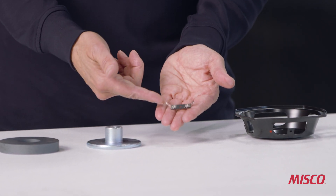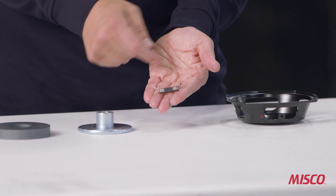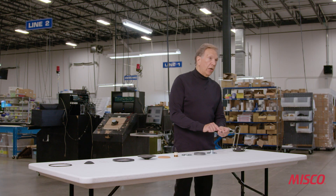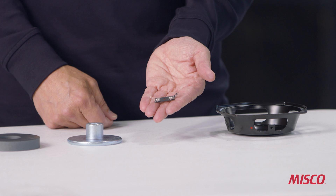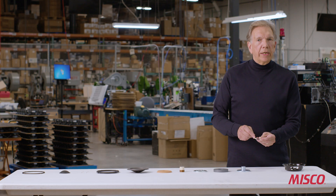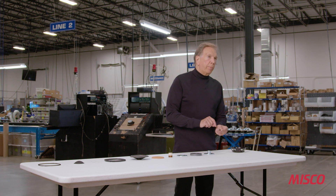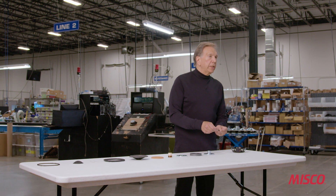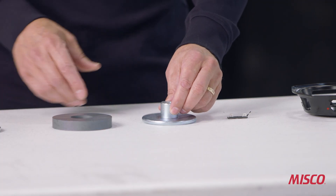This small part is a terminal strip and it's made out of two parts: a lug and an insulator board. The lug is used to attach the lead set that's going to be connecting to outside the woofer. The lugs on this particular board are 0.205 inches wide by 0.02 inches thick.